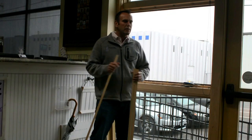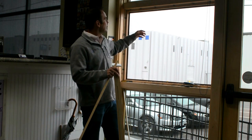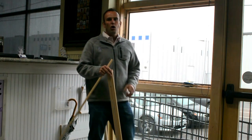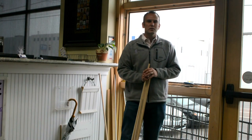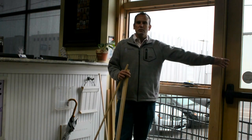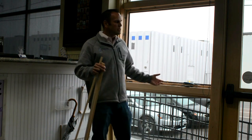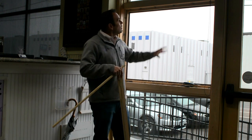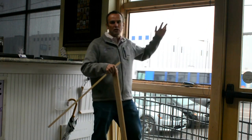What does glazing mean? Glazing is the insulated piece of glass that's inside of this window system. There's actually one, two, three windows and a door that is all mulled — the industry term where you're attaching parts and pieces together to make an entry system. This all has to be tempered glass because it's within 24 inches of the door. When this glass broke, it didn't fall into a bunch of pieces, but obviously it did break and we had to fix it.